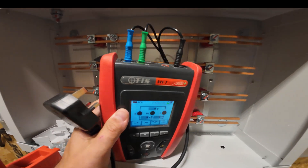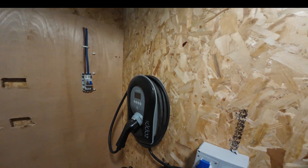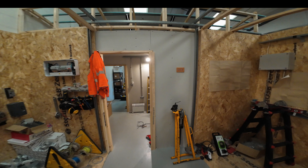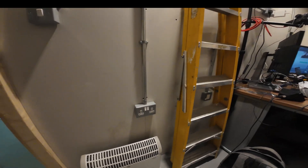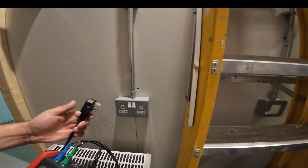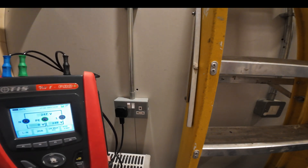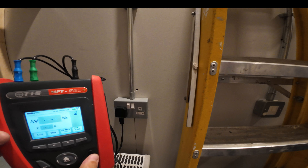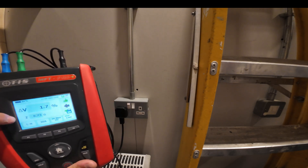If I take the test instrument now, you can see it's lost its measurement of voltage and we'll wander off past my Remyy holder, past the Zappi, and we'll go deep into the install to this socket at end of line in this little space here. Again I'll bring you down to the right level, get the test set into position. If we plug that in and turn the power on you'll see we start to measure voltage again. Now all we need to do is press the test button and it's going to reference that first nulling and give us a value.